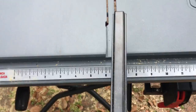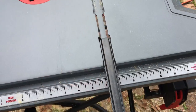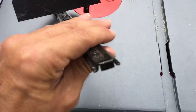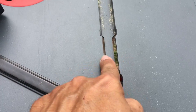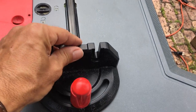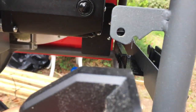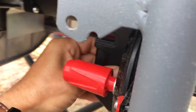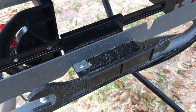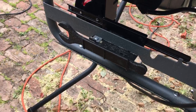Now this little miter slide thing, miter shuttle sled, slides along in these channels. And it actually locks in. I don't think I'd mentioned that yet. It's got this little flange on the sides that gives it a sort of a T profile. And that is held down by these little lips here. And keeps it a little bit more stable, although you see that it will rock when it's in there. So you have to make sure you're pushing down on it as you're sliding it. But this piece fits into a little bit of a channel holder underneath. So it stores underneath too. And these guys here, this is actually a pair of wrenches that come with the saw. They're used to undo the blade if you want to do a blade change, or if you want to take the blade out so you can clean it in case you get resin or something on it.